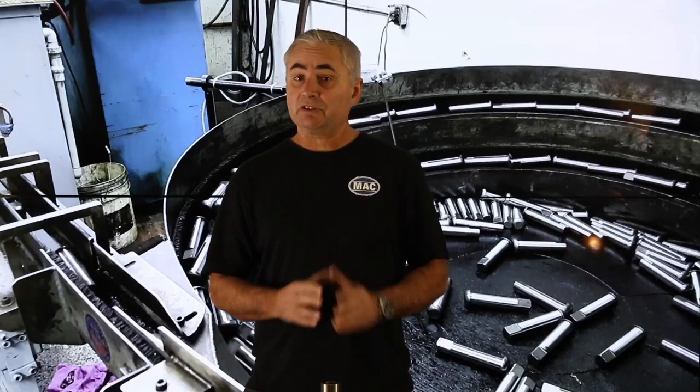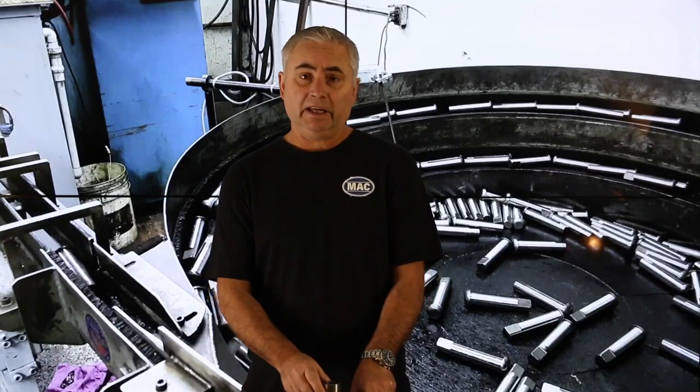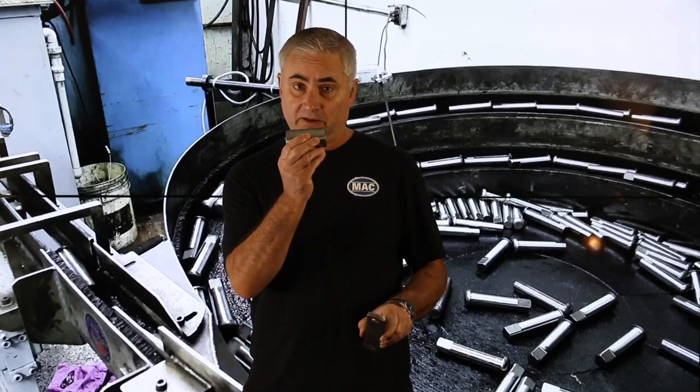You can then upgrade to a WH series fully heat treated chain. So just like the WR series chain, the WH series has hardened pins and hardened sidebars and barrels. The WH series heat treated chain is ideal for maximum service life. It's ideal for high impact side loading and high speed or abrasive conditions.